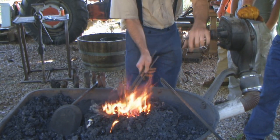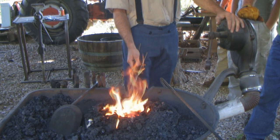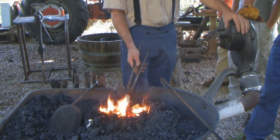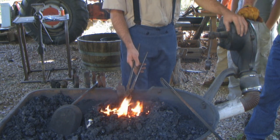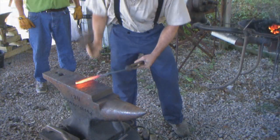So if you just lay them down — actually the best thing to do to finish a blade, if you're making a blade, is putting them in a bucket of ashes or something that makes them cool over three or four hours, and you can take a file and just shave it. It's really soft and malleable, but a lot of times I'll lay it beside the anvil and in 15 minutes I'll pick it up.